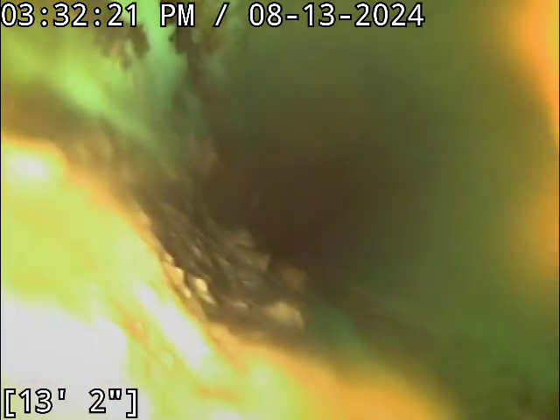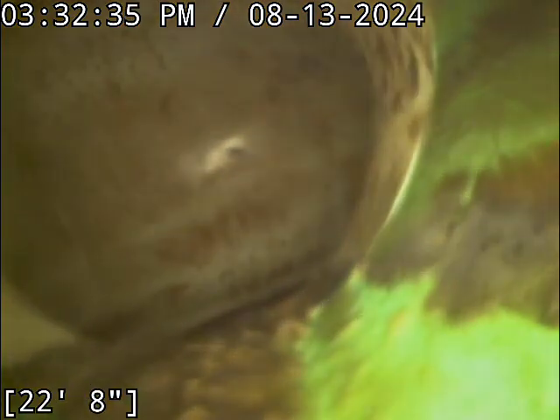What you're going to see here is we've got a lot of grease filled up in the sewer line. My camera's already zeroed out — we're just going to push through this thing. We're going to get out here about 22 feet. What I'm recommending is the line get cleaned. You have very, very thick grease and debris buildup in the line — it's an inch thick at its worst points. There's the main there, and the line goes out and terminates just in the back alleyway where the driveway goes out to.